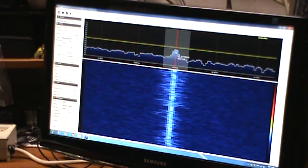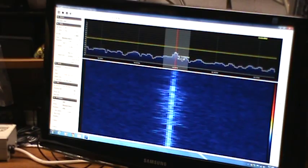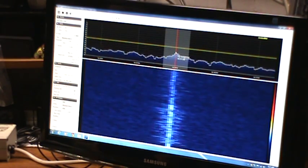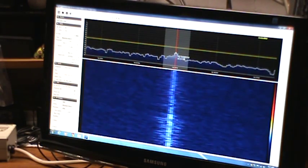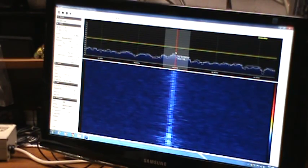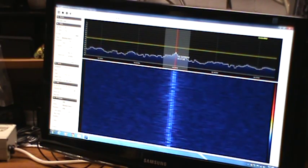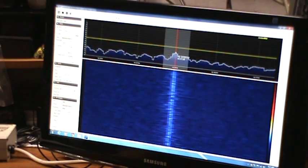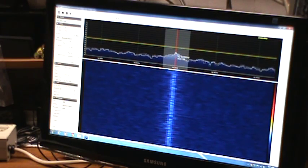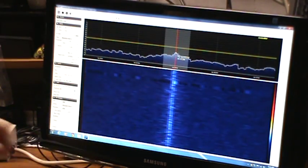Now I can switch the antennas. So here's no antenna, which should be grounded. I'm still getting a pretty good strong signal, still about 46.6. So apparently this switch is letting the signal bleed in. Not that great a switch, because I'm supposedly on the ground or neutral position, so I shouldn't be getting any effect of an antenna. It kind of makes me worry that it's really letting both antennas come in. Or maybe the coax cable that goes from the dongle to the switch is acting as an antenna. But the signal level is about the same as no antenna.